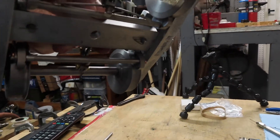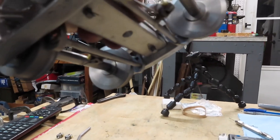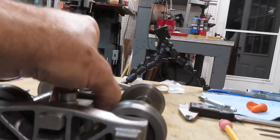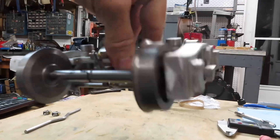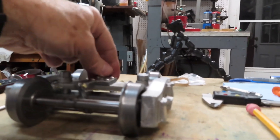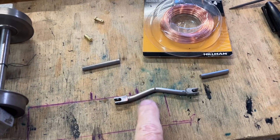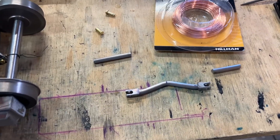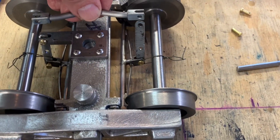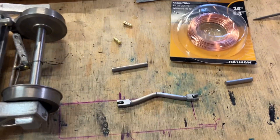While I've got it together like this I thought it would make a cool video to show you the undercarriage. Obviously it's not all in permanent position yet, but I've pushed the brake shoes right up to the wheels — you can see I've got some little wire ties there holding things in place. I can't wait to fully finish this pair of trucks. I'll cut the little ends after carefully measuring the length of the little bent rod. The dimensions are going to be good, so I'll just adjust carefully before I silver solder it and bring you back once that's done.